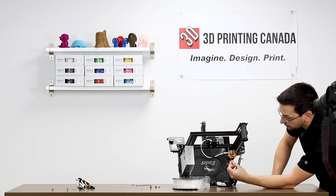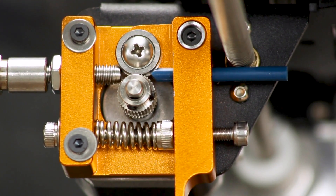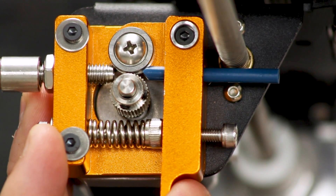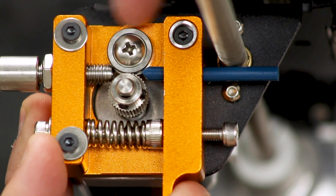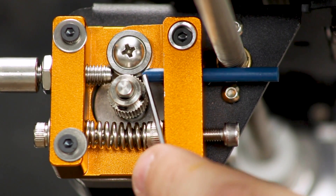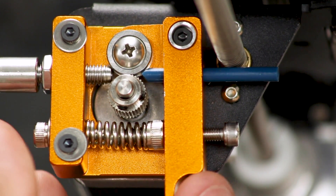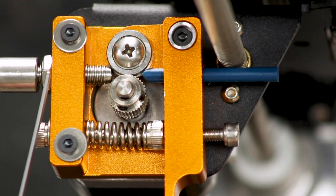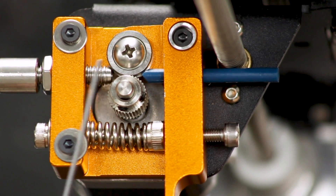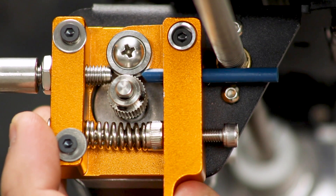The instructions state they've kept this metal tube pretty far back so it's not contacting the gear or the idler pulley. With no filament in there, if you had filament loaded the lever would close and there would be no contact between the idler gear and that metal tube — very, very little clearance, which is perfect. The Teflon tube slid in here has very little clearance to the idler gear and is as close as we can get it to the tooth gear. We don't really need to do any adjustments here; if we did, we would loosen this nut and thread the tube in or out to change the clearance distance.